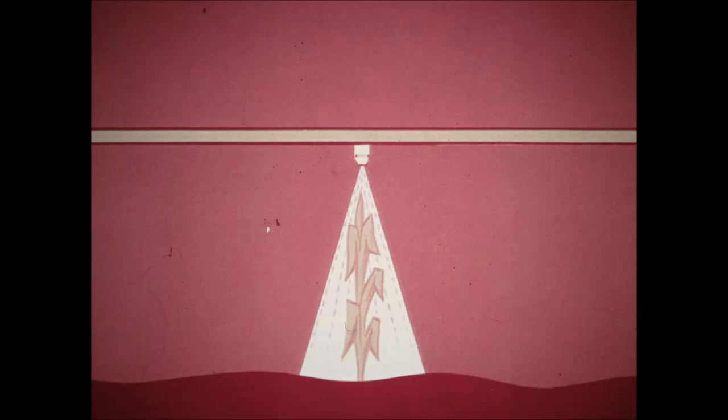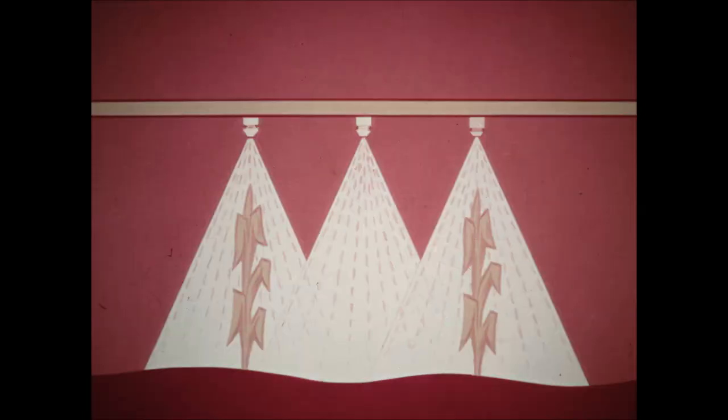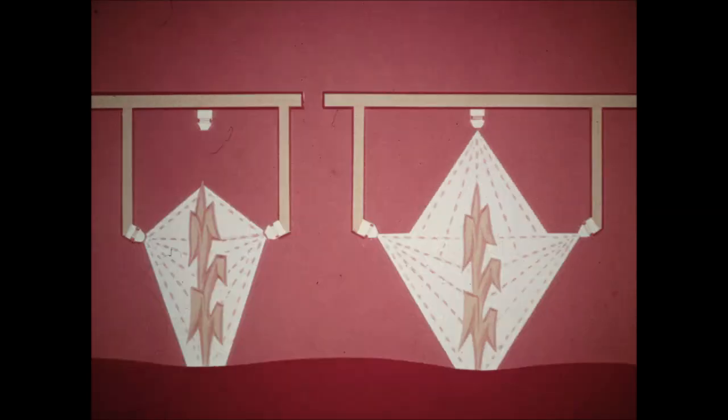By changing the location of nozzles on the sprayer's boom, you can obtain any coverage desired. For example, here's how 1 nozzle centered over a 40-inch row sprays a corn plant. With 2 nozzles per 40-inch corn row, you obtain this coverage. Note how spray hits both the plant and soil. You can use row crop drops with or without a nozzle in between to direct the spray only on the plant and reduce the amount of chemical required for thorough coverage.